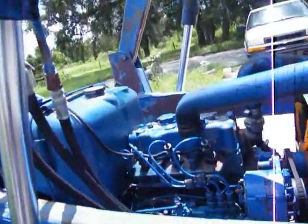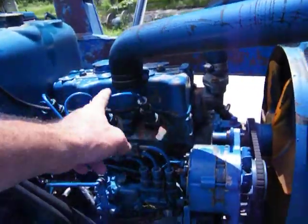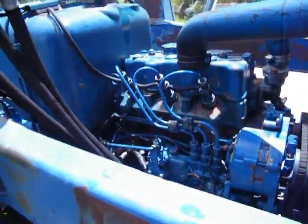Okay, I bled all the injectors up here. I don't really have to do the pump because, you know, obviously go to the pump to get up through here. She cranks right up. No problem. Let's walk on the other side and control it. Nah, that should be fine.